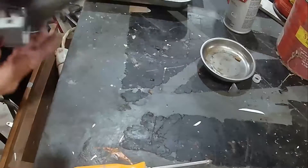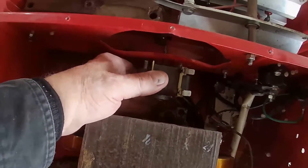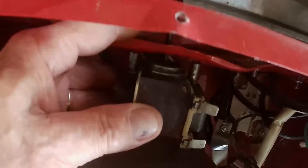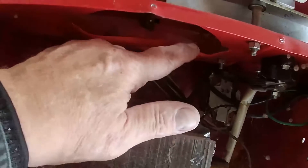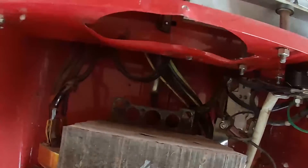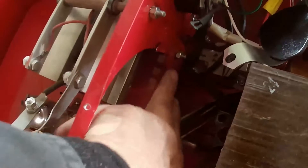That way you'll be able to use this motor on the welder as a cooling fan. Originally the motor bolted in with the fan blades up above it, but with my new motor and bracket I'm going to remove the old bracket and use the new one. I'll have to drill a couple of holes — I'll use the existing bolt to anchor one end and bring the other end up where I can easily get to it.